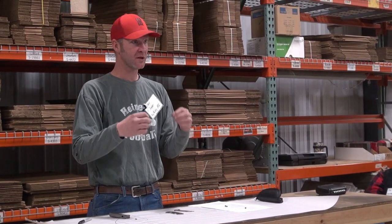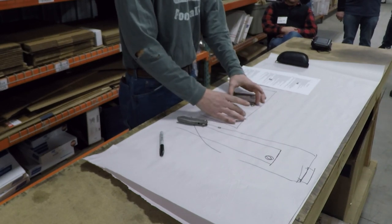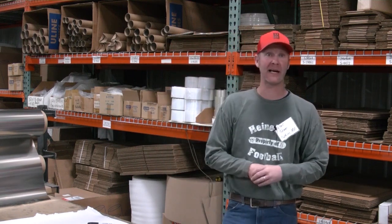They're tapered holes, and they're for 3/32 pins. I can set these up, and they'll be perfectly the same thing across there, and I can go and mill everything out, and they're perfect every time. It's dead nuts, but it's called a mirror jig.